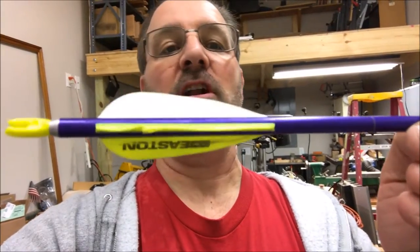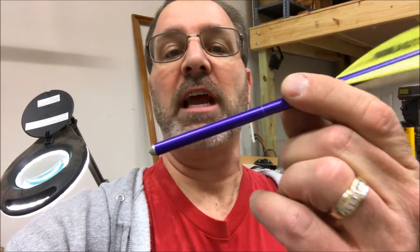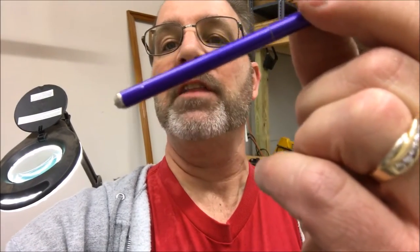The arrow he gave me had bad fletchings on it, but he said if it worked out he'd swap new fletchings on his arrow, because I'm making this for one of the guys up at the range, and he'd put new fletching on there so he'd have a cool-looking arrow. This is awesome. It's slow because as you start to turn the reamer it'll kind of clog up with the aluminum and you've got to back it out, clean it, and then put it back in. There's still an issue with holding it — I'm using neoprene and some clamps. If I could find a better way to hold it without damaging it — you could tell I did not damage it. If you look at the arrow, it's perfect all the way around. That one little dot on the end there, that's how they come from the factory. I'm happy. This is awesome.